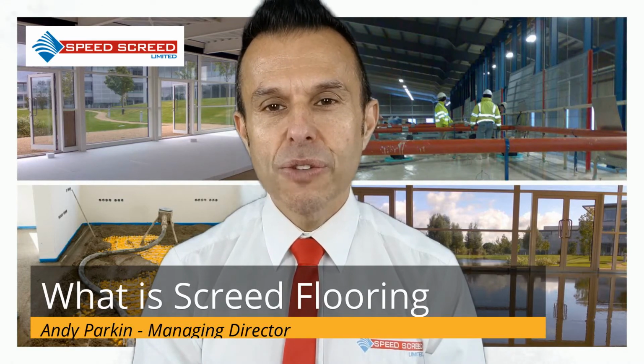So what is Screed Flooring? Floor screed is basically a material made by combining cement and sand, which is then used as a base on top of a concrete floor. There are different types of screed flooring which vary according to their use.